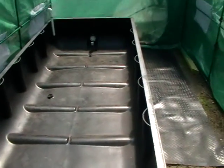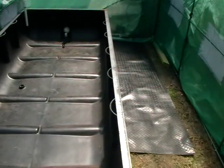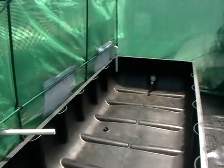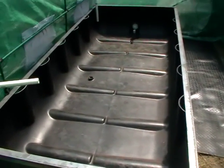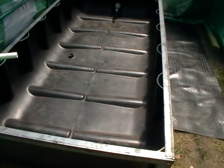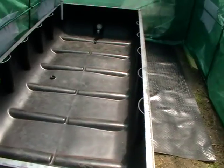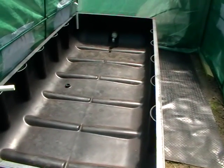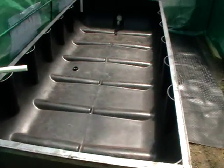The custom tank was made to an excellent standard - it's about seven millimeters thick with good food-safe and fish-safe plastics. Metal frames were built for it with high-tensile bolts - really solid stuff. By next week there'll be a floating raft system in this one; it'll be a buoyant system using two boards rather than stock polystyrene. There will be 75mm net pots and possibly some 100mm ones as well. This bed is about 1400 liters - quite a bit larger than the other one.